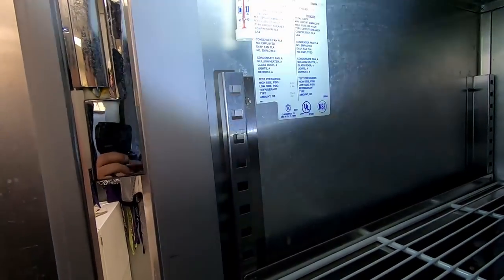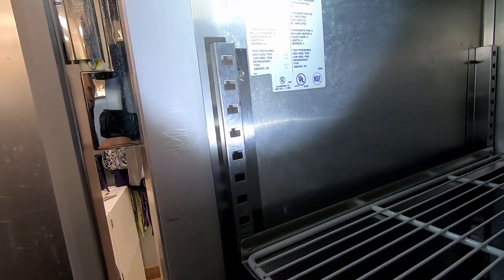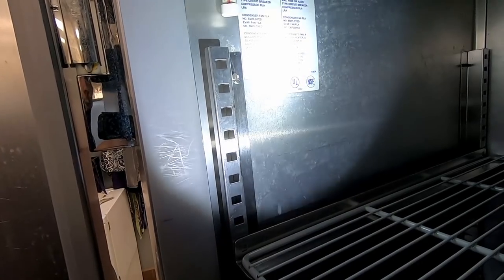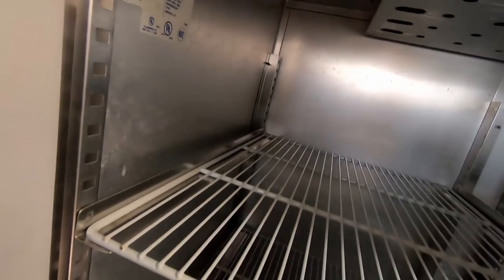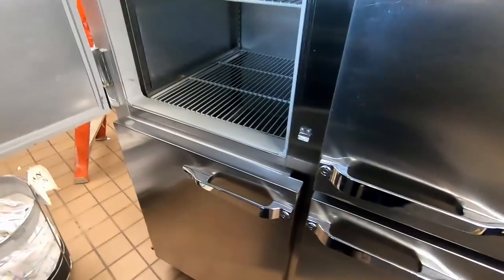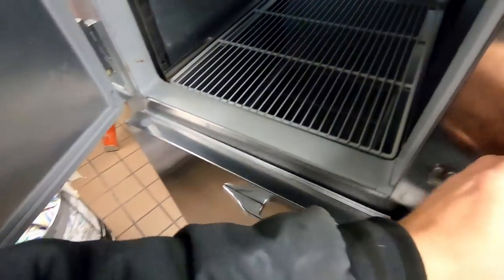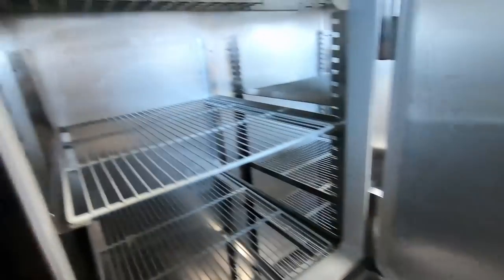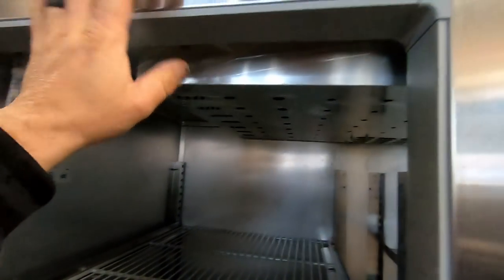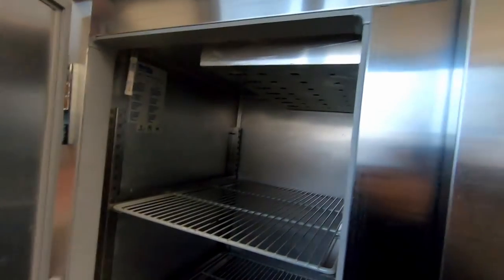This thing is 20 years old, it's 115 volts and runs on R-22. It's gonna get a little old there, but at least this is a pretty nice cooler and it's in pretty good shape - seals are in good shape. You can replace the components in this thing and get a lot longer life out of it. When it's in this good shape I don't see any good reason to can it - just buy one of the new things that are gonna fall apart even quicker. Let's go ahead and get the ammeter on here.